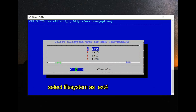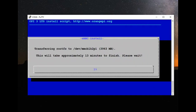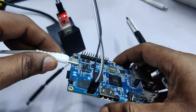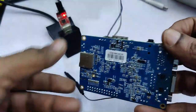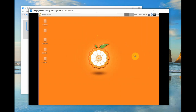Select ext4 file system — as it is a Linux system it will format to ext4. Once the format is over it will start loading the operating system onto the eMMC. Finally click on Power Off. If you switch on the power button again — you can remove the SD card now — provide the power again to see the operating system booting from the NAND flash eMMC. Thank you for watching.